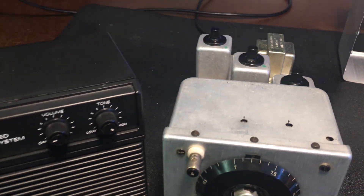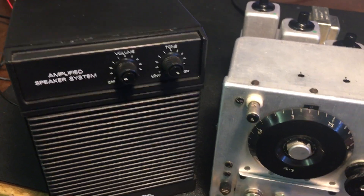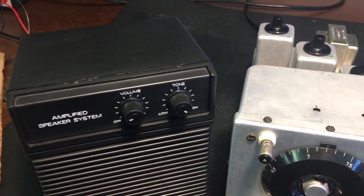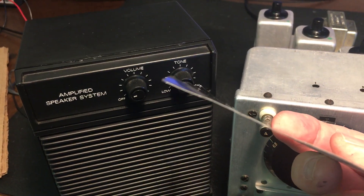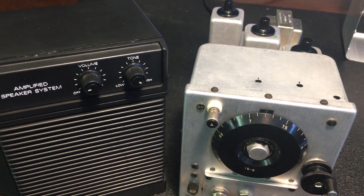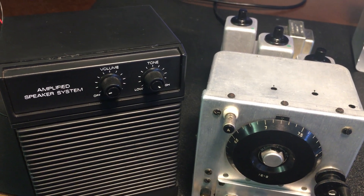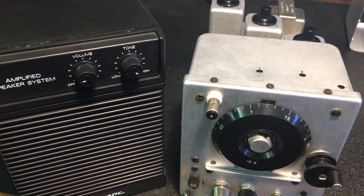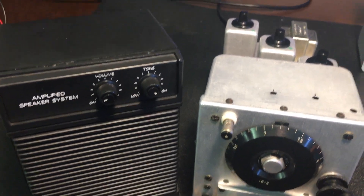It came off a steel chassis, so I ordered some mu metal, and I'll show you what it looks like here. It's very thin, and it's used for RF and audio shielding. I've been doing a lot of reading. It contains 80.3% nickel, 14.3% iron, and 5.4% molybdenum, and I was really impressed with what the results could be for this radio.